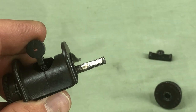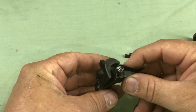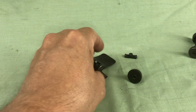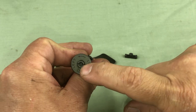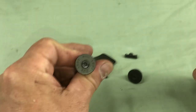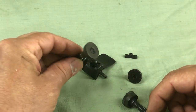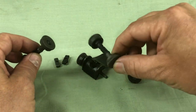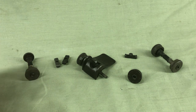If you look at this pinion, it's split right there — that's opened up and that's the reason why we have trouble getting lock bars off. Now that the lock bar is off, theoretically everything should still come apart. The later pinions don't have the upset area at the end — that's one way to tell them apart. They're also longer than the ones with the flush nut. The flush nuts are called a short pinion; it's physically shorter than the type 3 lock bar and late sights.